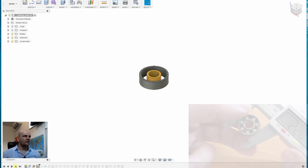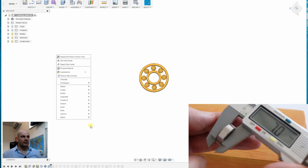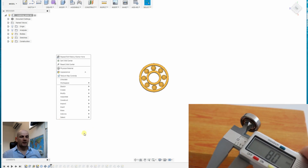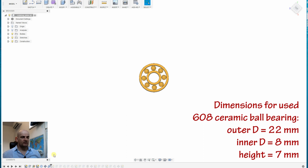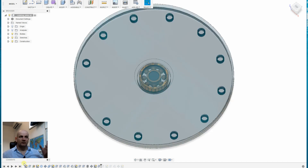Okay, let's see the design. These are my design steps in Fusion 360. I started with the ball bearing — I measured the dimensions of my ceramic ball bearing and built the design around it. I started with the plate and added slots where I can place the M6 nuts to get more weight, more mass at the edge of the plate, so it will rotate more continuously.